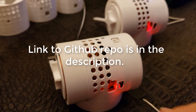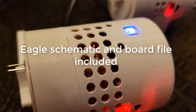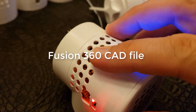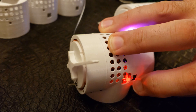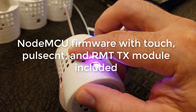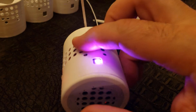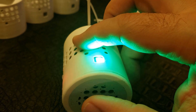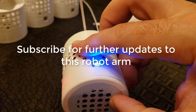Thanks for watching. There's a link to the GitHub repo in the description. The GitHub has the PCB schematic and board files in Eagle format, a bill of materials for everything you need to buy, and Fusion 360 files so you can modify it yourself — Fusion 360 is free for makers, by the way. There's also the NodeMCU ESP32 Lua firmware including my touch module, pulse counter module, and RMT-TX module for sending G-code. You'll need to upload that firmware to your ESP32 and install the Lua code. There's also a link to the Chili Pepper work-in-progress workspace for this robot.